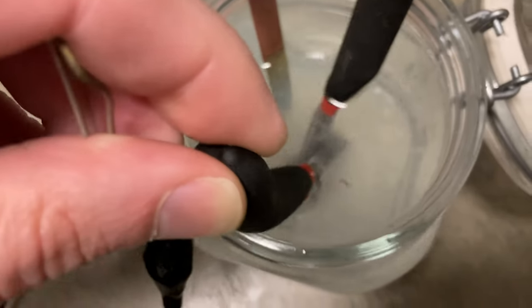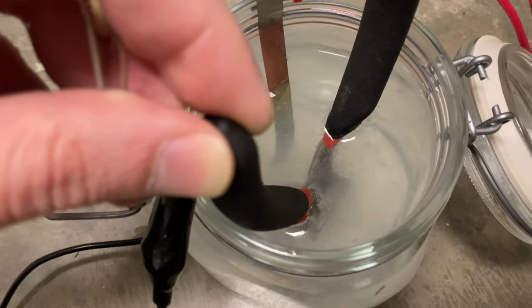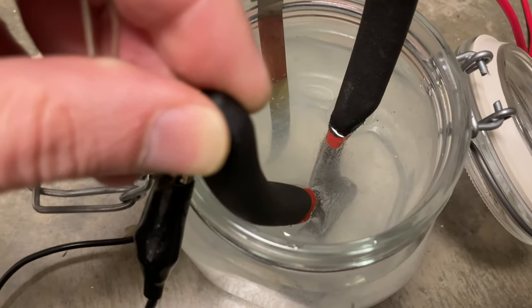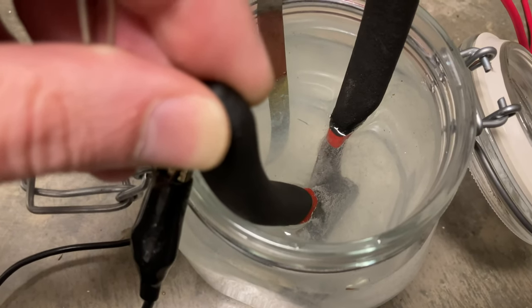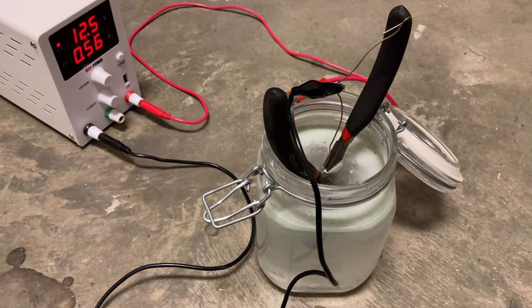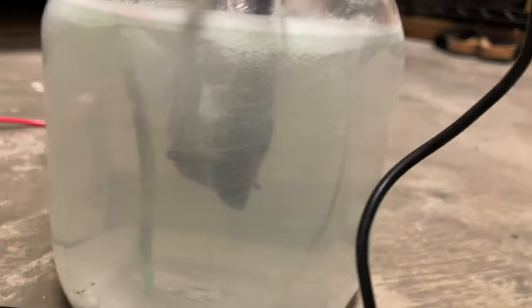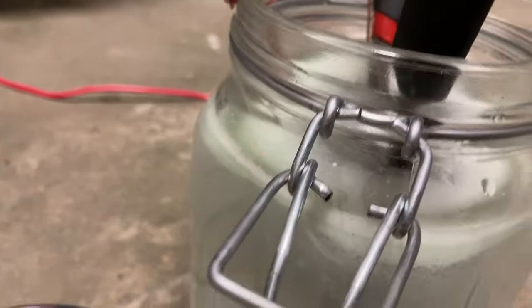See rust particles floating off there. What I'm going to do — I have to sharpen them after this — but I'm going to nickel plate the part also after I electrolytically clean it. We can see that the process is proceeding. What's happening here is hydrogen is evolving off the tool and the anode is being oxidized. That's green copper oxide that you're seeing there, and what it's doing is breaking the iron oxide off of the iron steel tool.